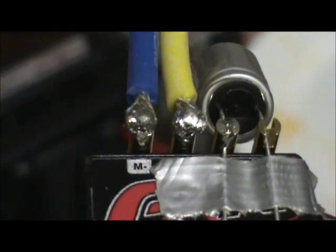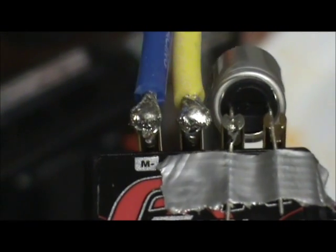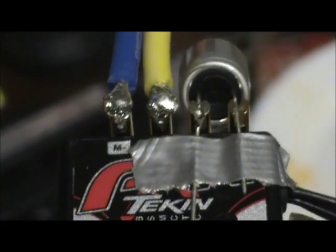I'm going to do the same thing on this other post. Then you just press the pre-tinned wires on top and melt them in. If you pre-tin all your stuff, it makes putting the pieces together so much easier.